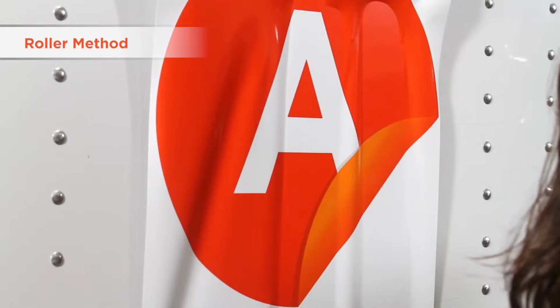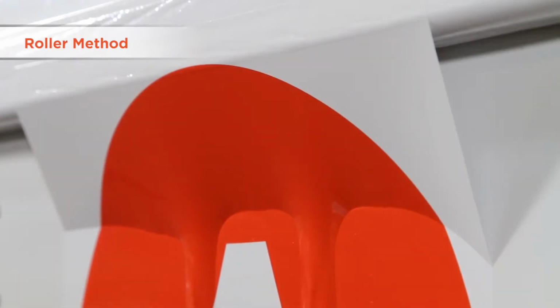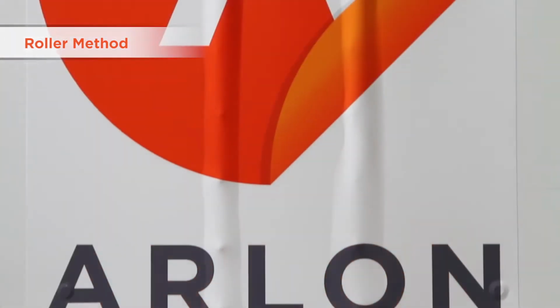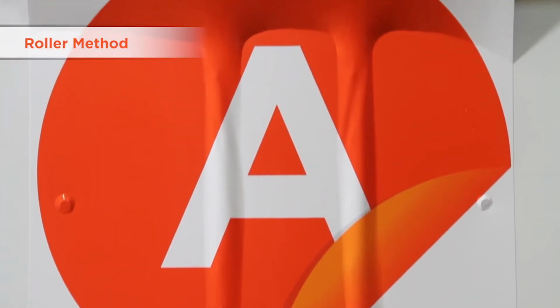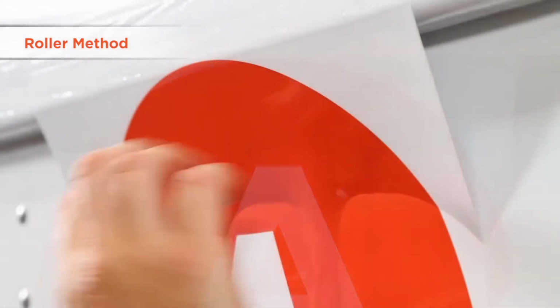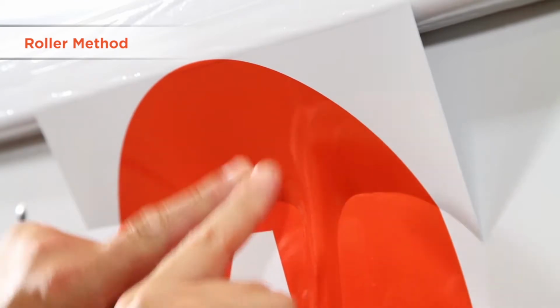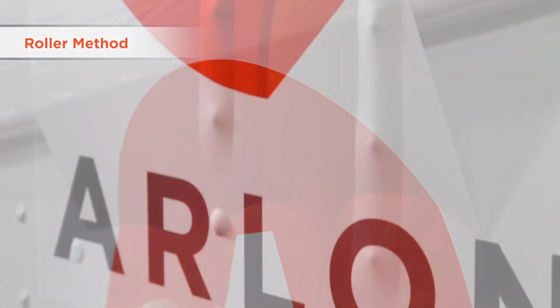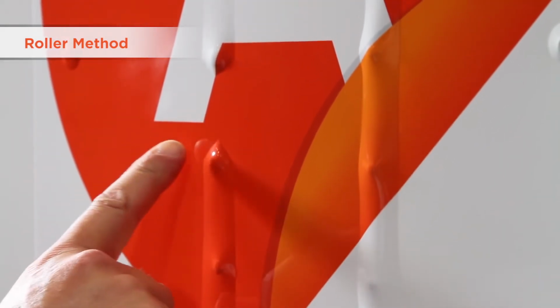leaving a vent over the line of rivets that begins at the bottom of the trailer and continues unbroken to the top of the trailer. The vent should be a consistent 1 inch wide at most. The top aluminum rail creates a natural horizontal vent which allows the air to escape in either direction. It's critical that this vent is unbroken from bottom to top.